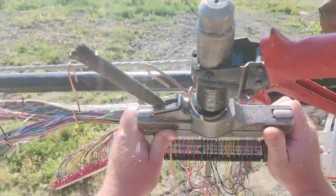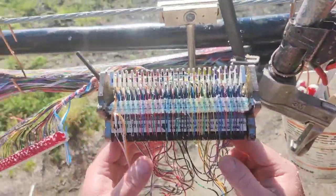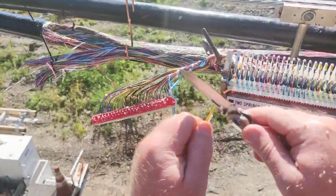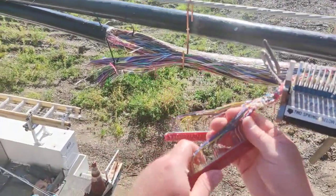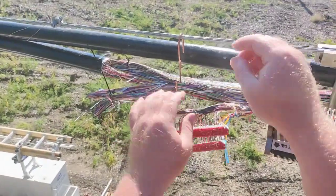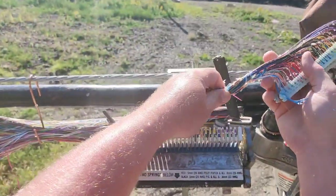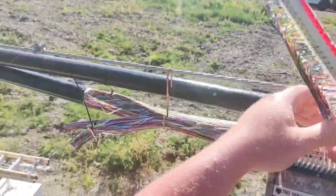Release the crimp head. How you know if you got them all in the right spot is when you pull the tag ends — the little scrap pieces — out and they all come out. If one jumped the track it'll be stuck and won't come out. Scrap those or do whatever you do with them. Take your pocket knife and cut the ends off. Now you have a nice flat mod that'll sit in the terminal really nicely. You can fit a lot more in there a lot easier, and your binders go all the way to the very end of your mod so you can look right here and see your red super binder, white-blue and white-orange binders.